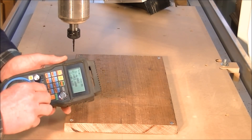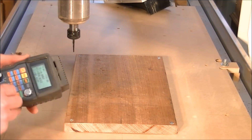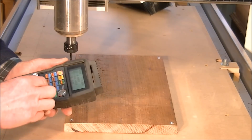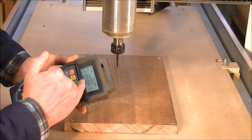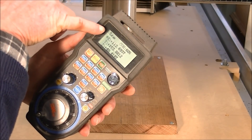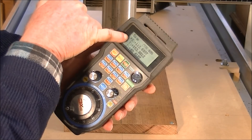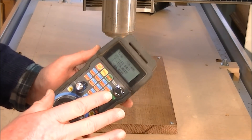You can alter the feed rate down to a very very small amount — each individual division is about a thousandth of an inch. Of course it's a little bit slow for what we want so we ramp it up a bit. It's very controllable and very precise. You also get the readout here — the percentage in jog tells you about the radio transmission quality, battery condition, and this little indicator shows you what axis you have selected.